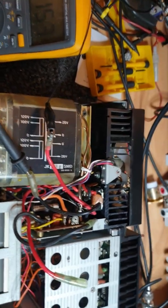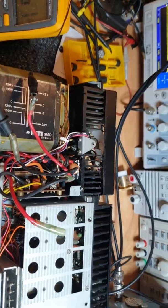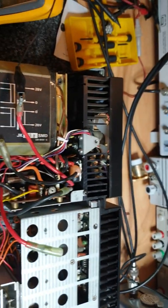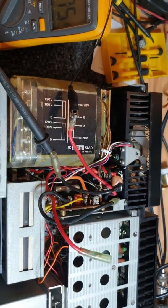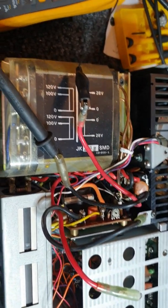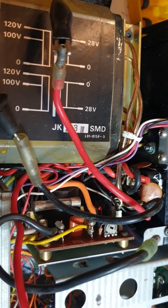I'm sorry that there's a part three, and possibly a part four. This is just to show you that you can get this bit right. Because we had set the transmit to exactly 100 watts, everything was working fine, and after loading up the power supply a little bit, she has absolutely had a nightmare blow up. I'd like to see where the flames were coming from. It's the 28 volt side that's open.